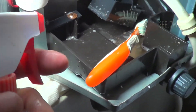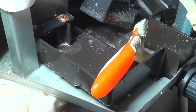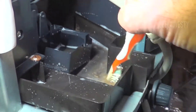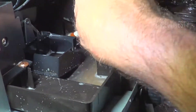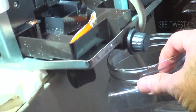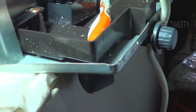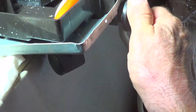I've got Windex I'm spraying in here, and I've got an old toothbrush and I'm scrubbing in here, trying to get the grunge out. Then I undo this plug here, drain it into a peanut butter jar. Then I'll put it level again, fill it up with water and scrub. I do this over and over again to clean the pan.